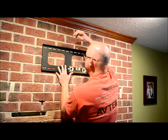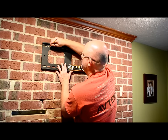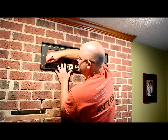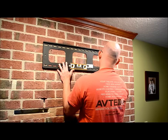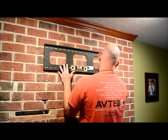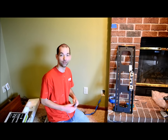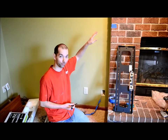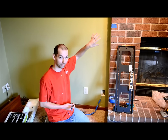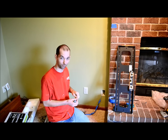You don't have to be exactly centered because you have plenty of play on the back of the TV. This mount is 32 inches wide and the arms on the back of the television are only 16 inches apart, so you have plenty of room to move it if you need to. After you get everything marked, all you have to do is drill the holes. The next step will be finding which wires we will need for this installation — in this circumstance we have three HDMIs and a cable for our infrared detector.